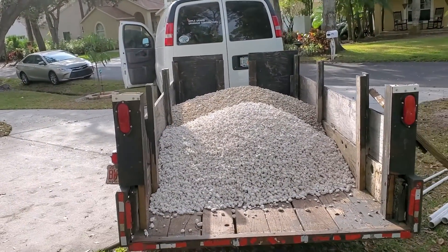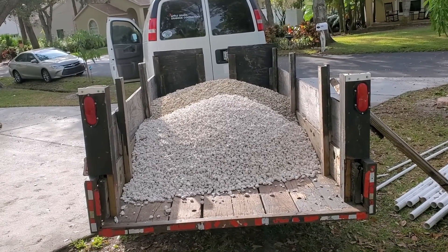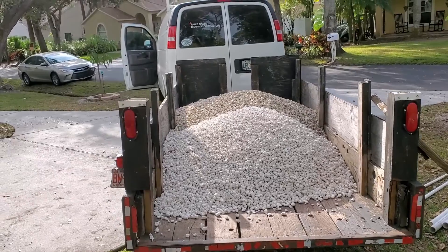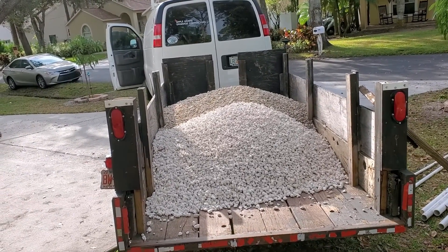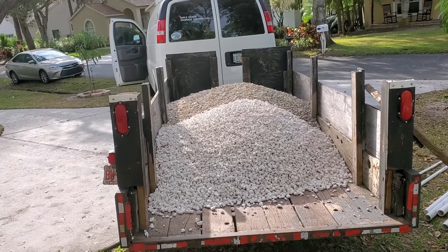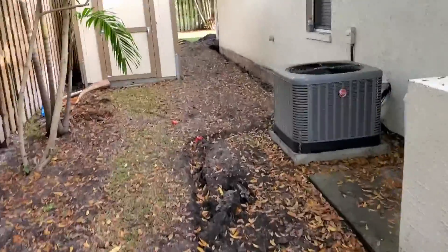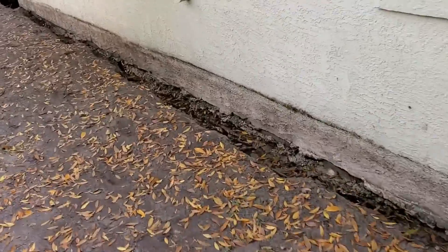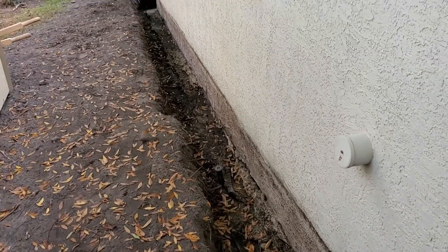The stone we're using here is limestone — it's very clean, what we use for drain fields and leach beds. Water perks right through this stuff — works really good. Three-quarter inch to inch-and-a-half stone is typical. We're going to put all that stone back here. We'll use the Easy Flow as the main system and then put stone on top of that and bring it all to grade.